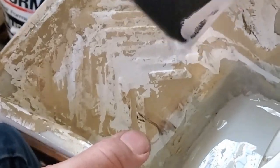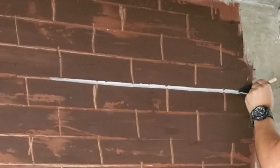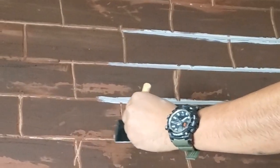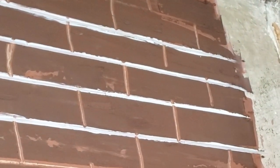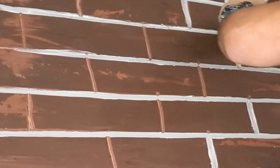Now we're going to get a paint sample — the cheapest amount of paint you can buy. I'm using a two-and-a-half-inch sponge brush instead of a regular brush because it marks really well in those grooves. The grooves themselves help keep you straight, but you don't want to be too perfect — we're looking for imperfection. I'm marking some lines thicker than others. If you notice drips or something that looks too artificial, scrape that paint with the brush edge after a few minutes to make it look rougher.